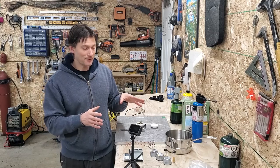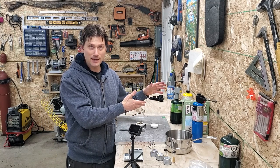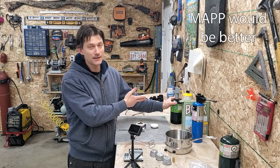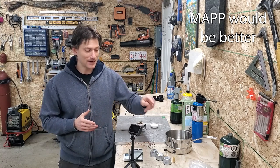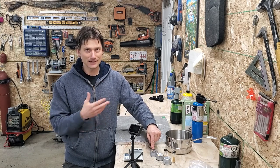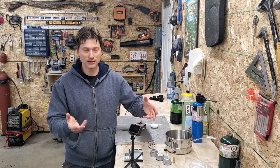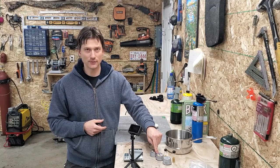So today, I'm going to do a third melt, showing you exactly how I would do this and just how easy it can be with nothing but a propane torch running propane. Show you the trick to that. And I really want to see if I can get that 97% capture rate again to confirm that the first wasn't less pure gold. It was actually a mistake with the torch splashing some of that gold out of the crucible. So hopefully we'll get that 97% capture rate.